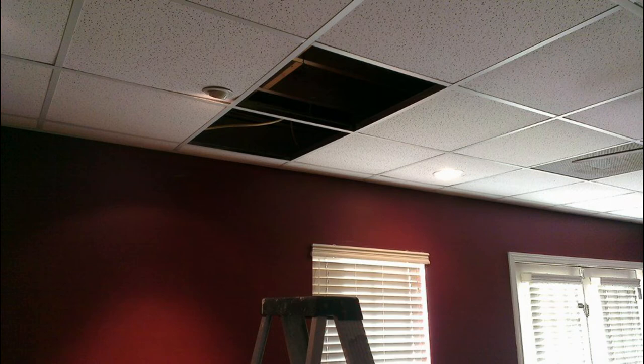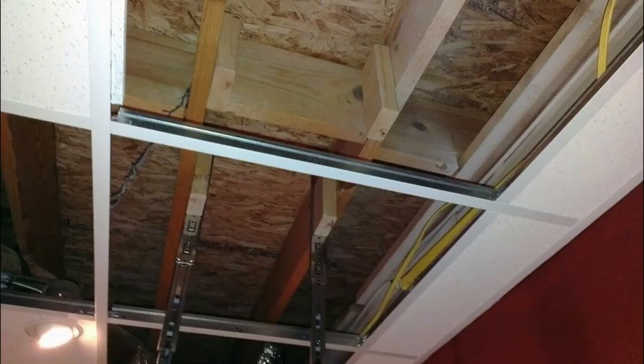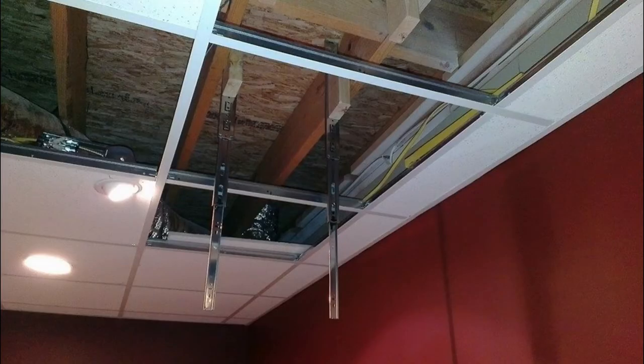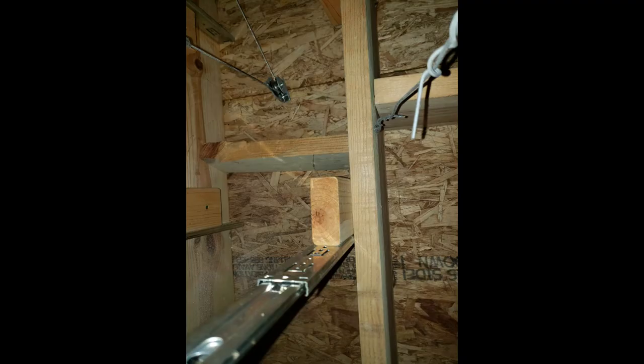I had previously determined I needed 36-inch drawer slides to retract enough from the ceiling to let the projector project on the screen accordingly. To get the drawer slides to mount in a way that would hold the projector mount, I needed to attach a piece of 2x4 to the floor joists in the four corners of the lift. I then attached one screw initially on each drawer slide into the 2x4 mount to let the slide hang free and level when retracted, then attached the second screw after confirming it was level. I measured the distance of the drawer slides from each other on the four corners and determined the size of the mount to be cut for the projector to sit on.